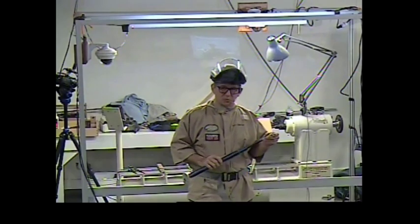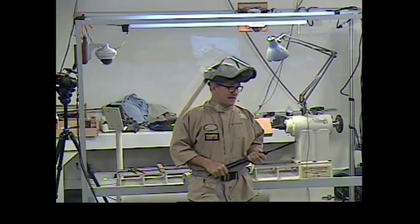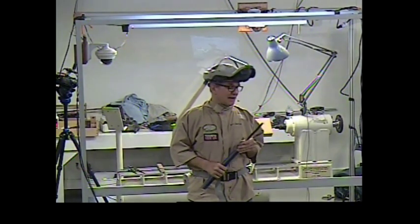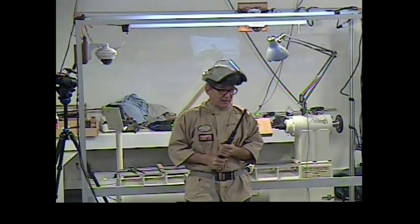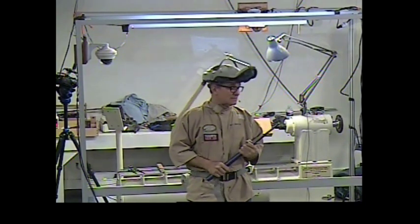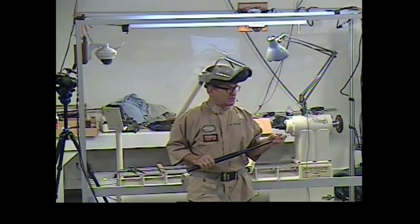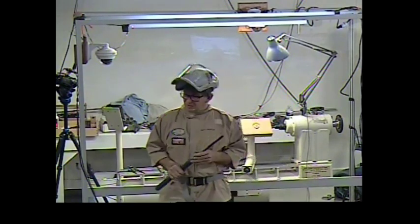I'm starting to use more and more of the 40-40 grind because it is definitely very easy to use. Easy to sharpen, and I find showing novice wood turners a 40-40 grind, they can learn faster and make it more enjoyable. So there's a lot of advantages to it. I still have my fingernail grinds because I like the shear planing of that, but this is pretty darn comfortable and it really works good for this demo.